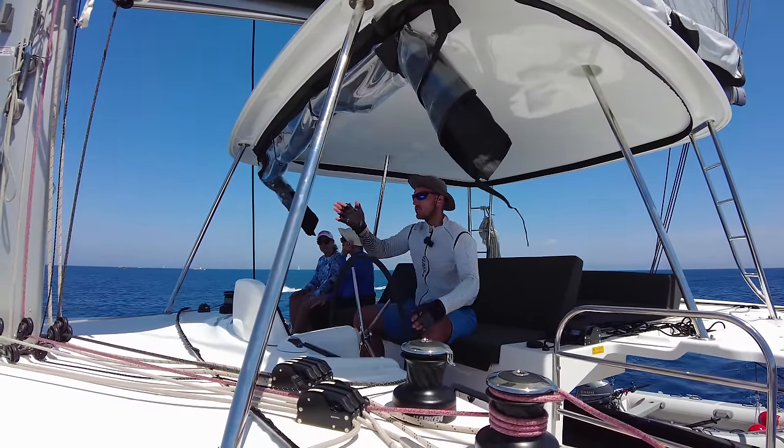Okay, now it seems like the anchor is kind of holding, yeah, so very good. So that's what you want to do. You want to drop anchor there, and then you want to reverse. But from the beginning until you drop two times the depth, you should go slowly, because the chain needs time to unroll.